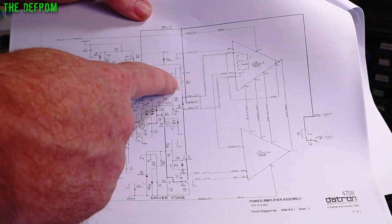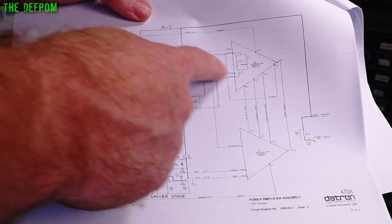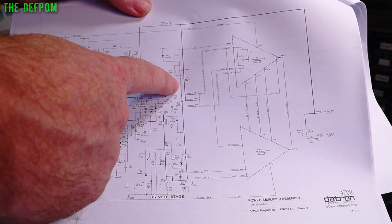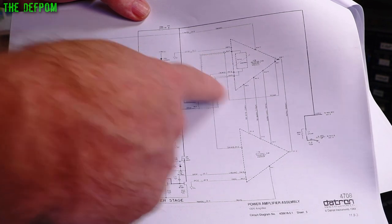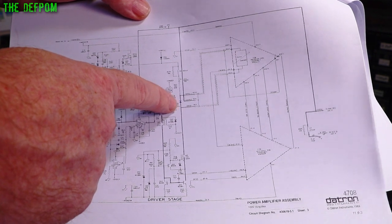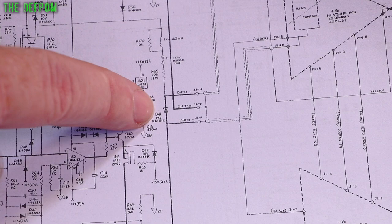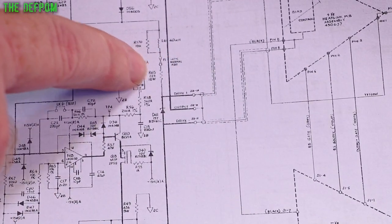There's a fuse right there which feeds the positive. I just tested that fuse, and it's open circuit. That fuse is blown. So does that mean we've got a fault on this board, or something further down which isn't quite right? Maybe that diode there is blown. I need to check that as well once I find it. So there's a fuse, and there's a diode I might have to check next. It's like a 15 volt Zener, and that supply comes through, and that fuse there is open.